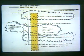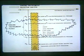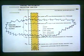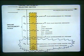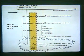Numbers one and four engine instrument fuses provide protection for the same group of engine instruments as number three, and in addition protect the supercharger oil pressure indicator associated with each outboard engine. Number two engine instrument fuse provides the same protection as number three and additionally protects the flap position indicator. Number five fuse in the AC fuse panel provides protection for the cabin, tail, left, and right wing heater fuel pressure indicators and the mixing valve position indicator on the stewardess panel in the buffet area.